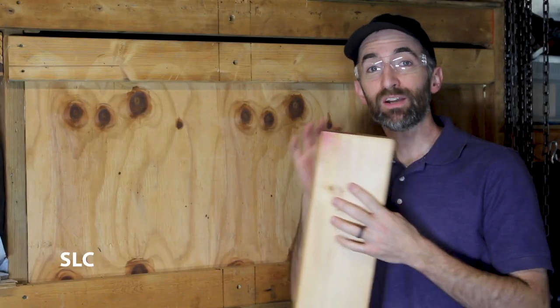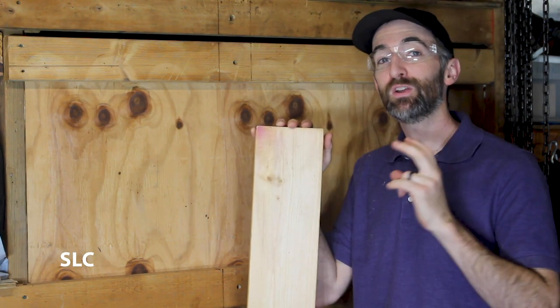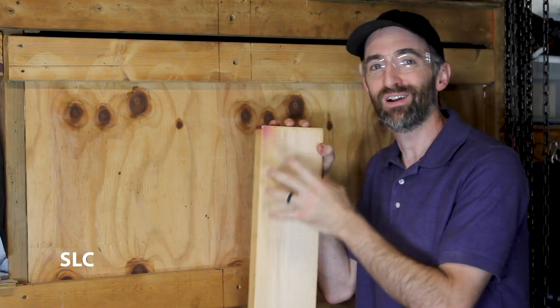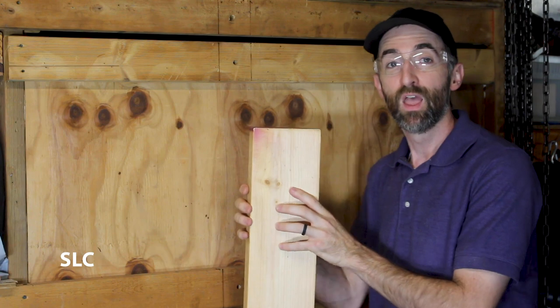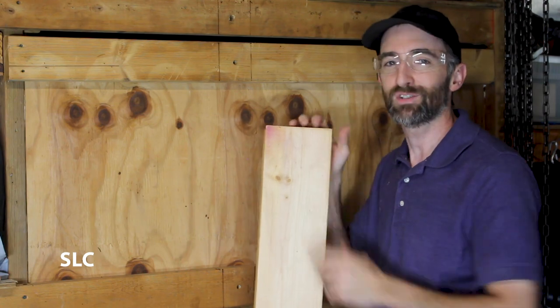For the rest of these boards I'm actually going to be using a two-by-six. Yes, two-by-six is major overkill for this kind of setup, but I'm going to use it for two reasons. One, I found this on the discount pile — take a look at your discount pile at your local hardware store, you can get a good discount on wood that is relatively usable. Also, I'm going to be ripping this down on the table saw so it'll be more like a two-by-three. So for those two reasons, that's why we're going to use this.